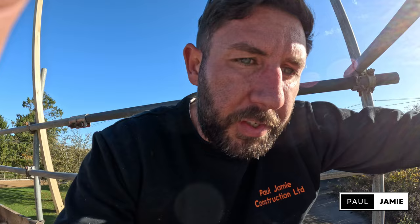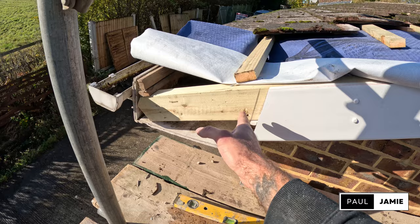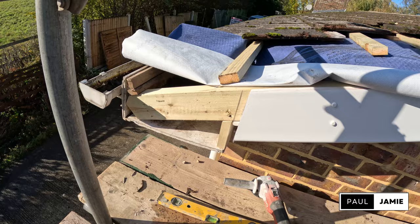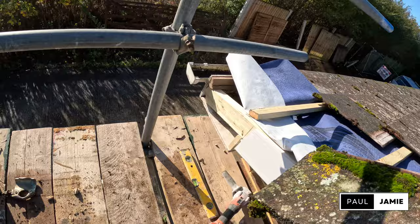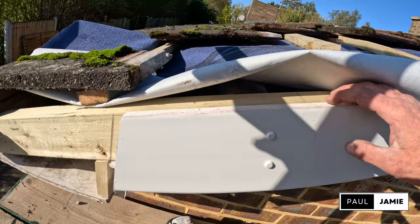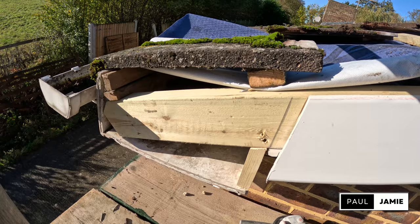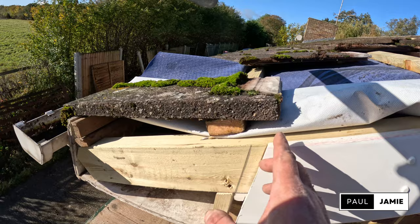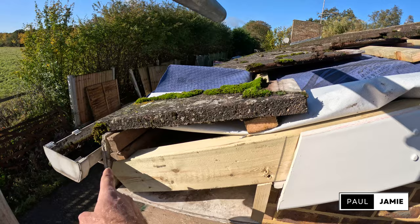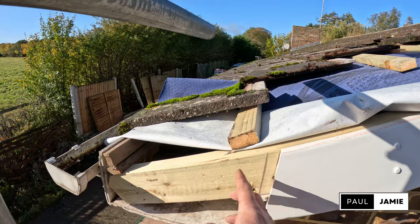I'm just jumping on this box end, I'll show you how I like to do it. You go with the first batten gauge because you need to put like a fillet — because when that tile sits on that batten and goes on that front edge, if you follow the fascia through it'll be flush there and you'll have this little gap. Some people like to follow that through and cut a piece of fascia to fill that in — but this is how you do a box end. So roughly around about where that gauge is — look where that tile is, that's bang on there. Then just measure from there to there, cut a wider piece in, and then you just scribe it down the back. This is the angle we want to follow, from here to the end there. I'll just measure that — it's 360mm, I'll cut that now.